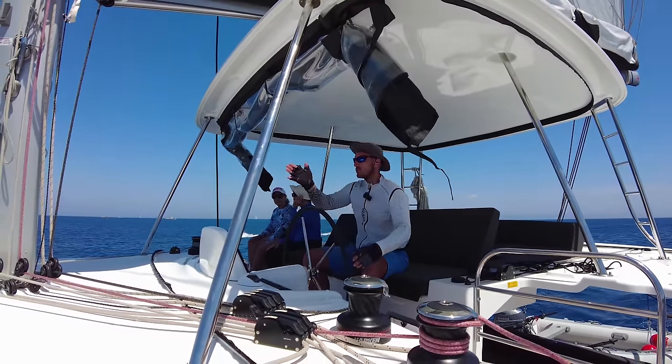Now this is a beautiful sail, as I've said, because it's not too deep. It's basically a light Genoa, so we can also go kind of upwind, and you can go 50 degrees of apparent wind angle. Right now we are on 56, so it's kind of the edge, but you can see it's performing beautifully. Many code zeros and sails look the same, but they're too deep, so right now they wouldn't be useful. So when you're buying this sail, make sure to ask your sail maker for the shape of the sail.